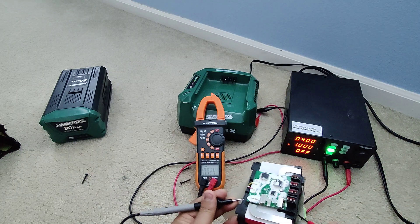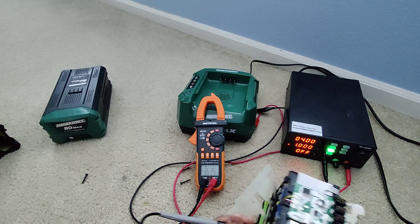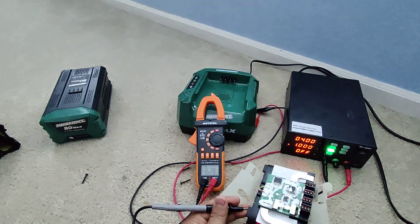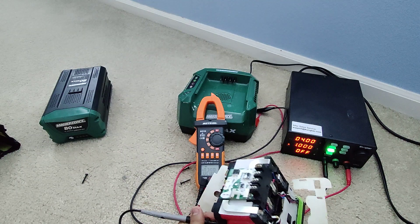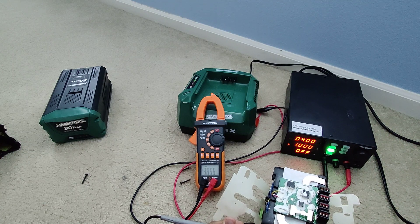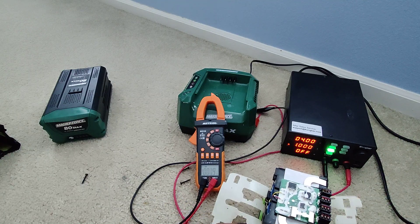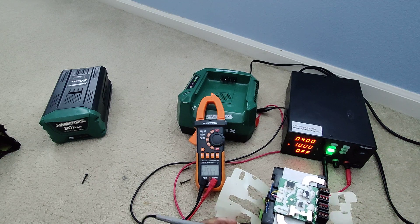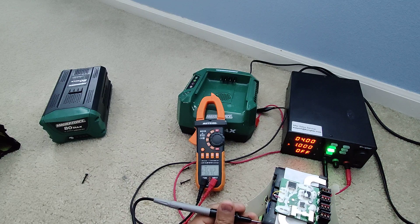There you go — 3.6. Let's see one down here: 3.6. Let's check this one: 3.628. And these down there: 3.8 — a little more than 3.6 but still low. Let's check this one: 3.897 — very close to 4 but not really fully charged. That's the problem — quite a few cells are undercharged.